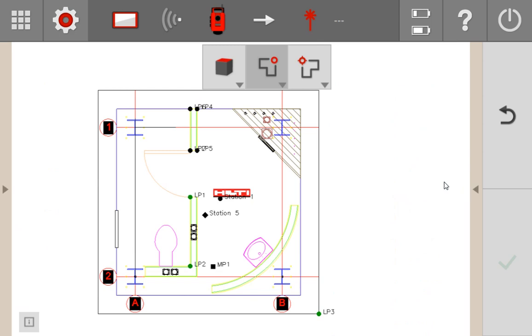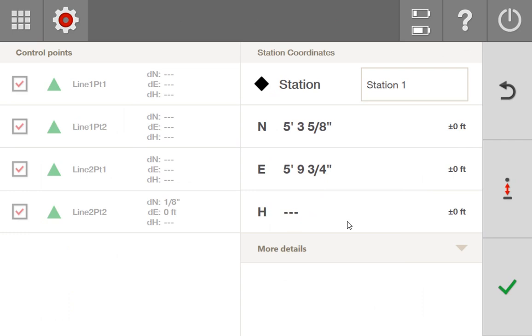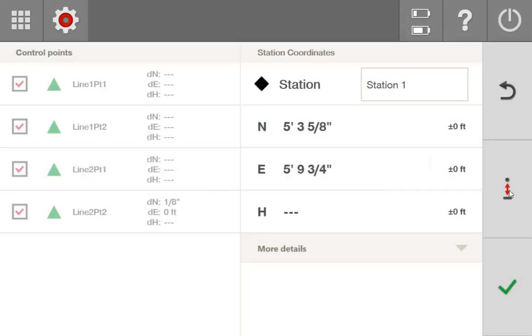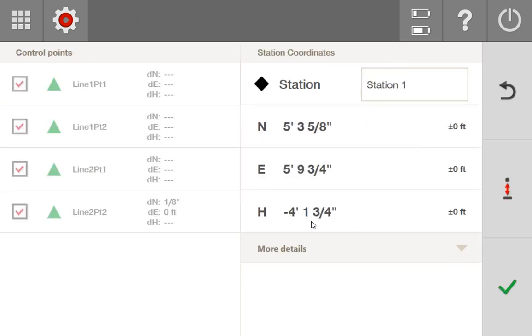Next, I'm going to station again, and this time in the height section I'm going to put in a benchmark height. After stationing, I go to my settings gear and turn heights on. It says height value is not set, and pressing the check mark warns me to set the station height before proceeding. In the stationing screen, I go to set station height and set a manual height to tell the tool where my 0 value is — essentially, where I want to lay out those 0-value points from the point list. I want those on the ceiling, so I turn the tool to the ceiling, measure it as the 0 benchmark height, and press check. The tool now shows it's below the ceiling, and the ceiling is recognized as 0.